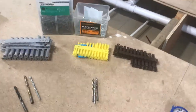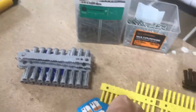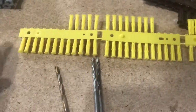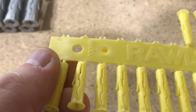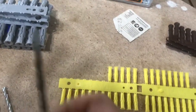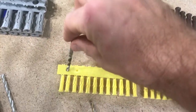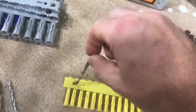What people don't realise is you have a look on here — these little holes are designed to help you do it. This one here on the yellows — yellow rawl plugs are always 5mm. Have a look at that little hole there: a 5mm drill bit fits right in the hole. This one's a wood drill, this one's a universal.